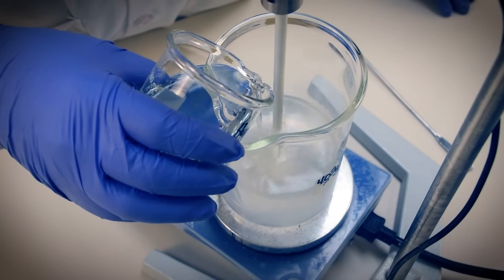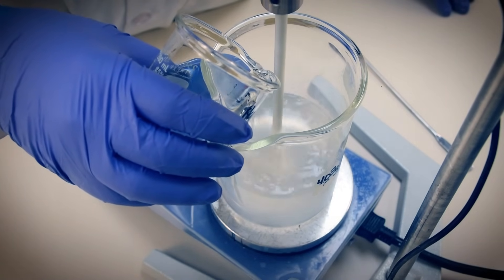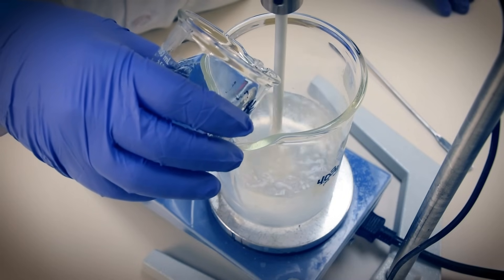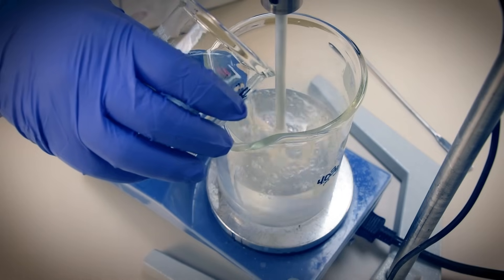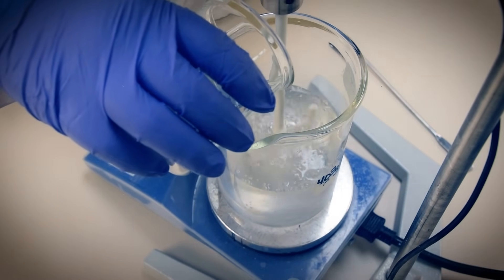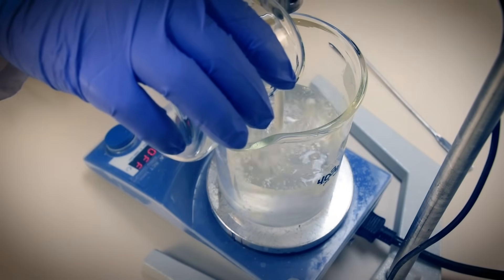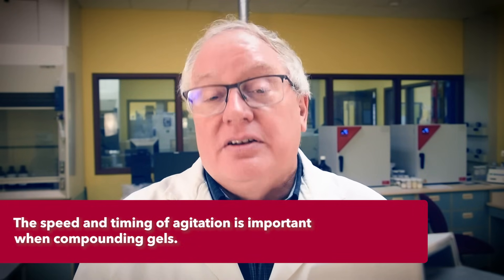Now, we might have added our ingredients in sequence as a one-pot process, but by conveying the amine neutralizer in a larger portion of water as a secondary phase and adding it to the batch under low agitation, we release much of the entrained air in our gel and attain a much more uniform final appearance. Whoever said looks don't matter probably wasn't making personal care products when they said it. We'll now let this mix at low speed until uniformity.